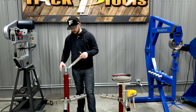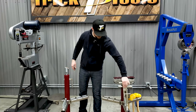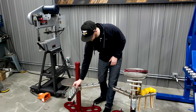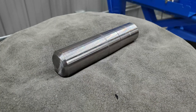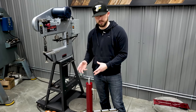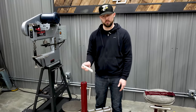Like I said, you can stick a T-Dollie in here at an angle. If you're trying to fit a fender over here and do some hammer work that way, it works really good for that purpose. We also have a Morse taper adapter that is just a blank, so you can weld anything you want to it and be able to put it in here. If you've got a forming head of your own that you want to put on the shaping station, you can buy one of these blanks and weld it to your own part.